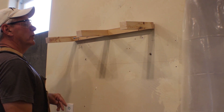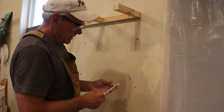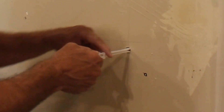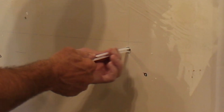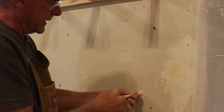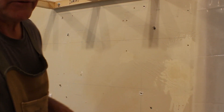The togglers go in the same way, same half-inch hole as the toggle bolts. You flatten it out so the flange can slip in. Once it's flush, you pull it tight — it's almost like a zip-tie type arrangement. You push it in as far as it goes, which secures the tabs in back against the back of the sheetrock. Then you bend and snap off the tabs, leaving a hole that your bolt goes into and ties to the back side of the toggler.